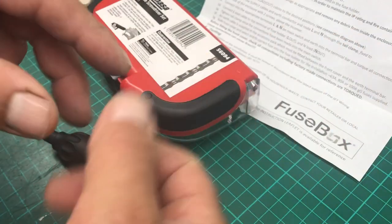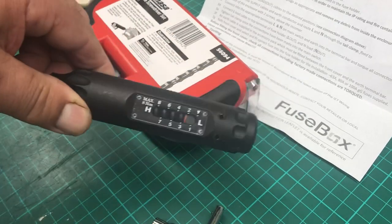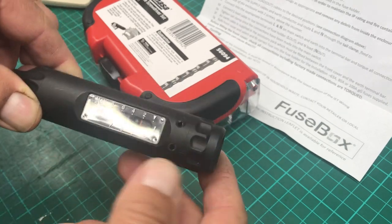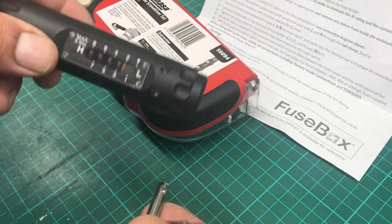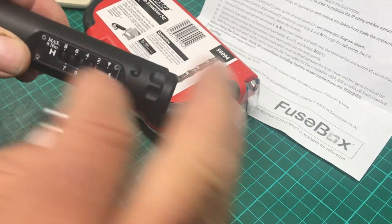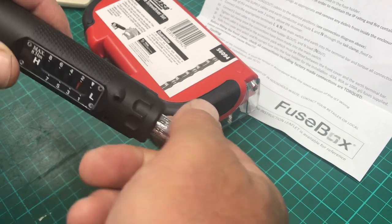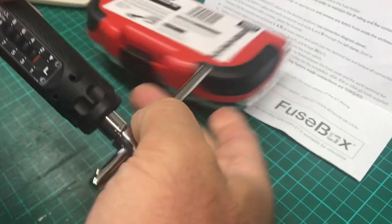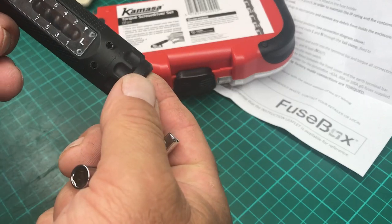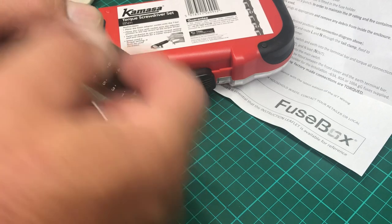You don't carry on after that click — it should just click again but one click is your signal to stop. It's quite a loud click, more noticeable than any of my torque wrenches. A couple of things to remember: I'm going to apply the same rules as a normal torque wrench. Whenever you finish with it, wind it back past zero so there's no tension on the spring, because if you leave it for 12 months the spring rate could change and alter the torque settings.